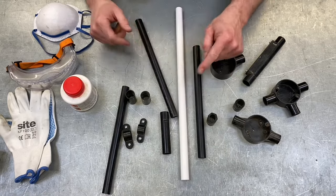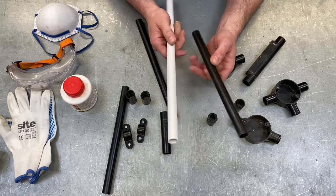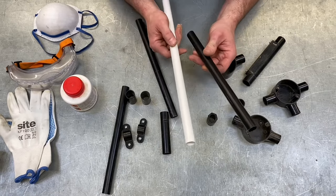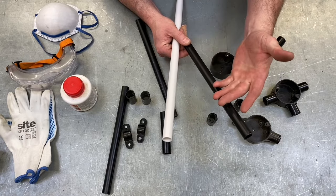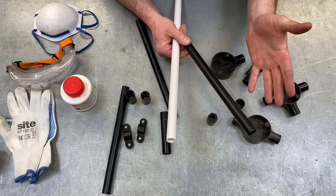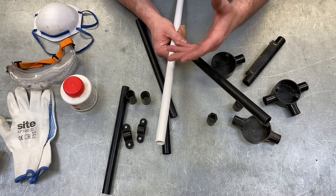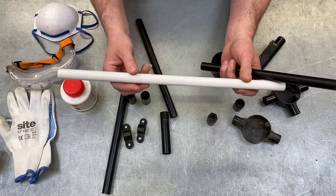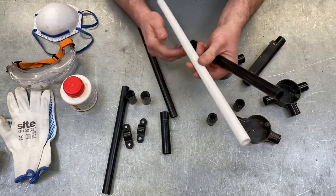They come in two standard colours, which is pretty obvious from the table: standard white and standard black. But there must be a reason why we have two different colours — we've got to think about the locations where they're going to be installed. Black PVC conduit, for exam purposes, will be used in industrial environments where there's likely to be airborne dust, or maybe people with dirty hands — parts of motor vehicle workshops, for example. White PVC conduit is used in places like offices, where it's more aesthetically pleasing against a cream wall.